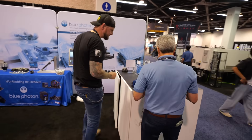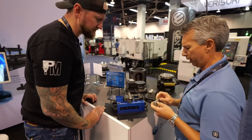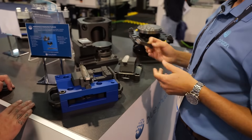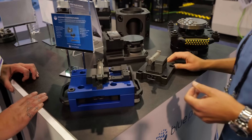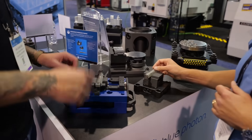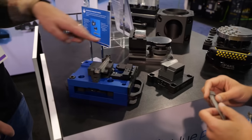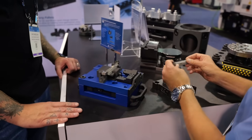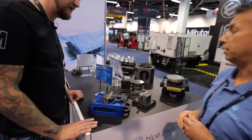This is really where we got our start — doing foils. Engine blades that are high value, very hard to hold. In this case, this is a custom sapphire that we do. But in larger foils, we can still use our gripper technology. Instead of just the contact point like you see on some of them, that entire surface is a contact point — it's an entirely machined sapphire so we can accurately hold location and the datums with that delicate part.